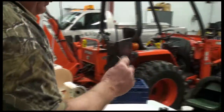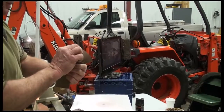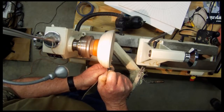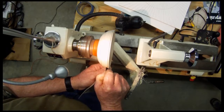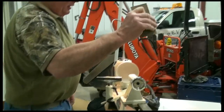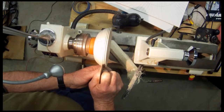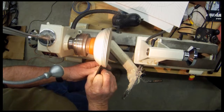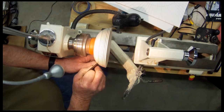There are a couple of ways to burn in these lines. Wires work good when you're fairly straight, but they don't work at all in a curved situation. I bought some really stiff sandpaper belt at a surplus store — probably five or six hundred feet of it, 120 grit. This is the way Nittman says to do it — he uses the edge of the sandpaper, and it helps if you've got a variable speed machine. You get two results: it sands the edge as you go. I've since switched to using plastic laminate tabletop scraps — I like it better. It burns a little deeper, a little quicker, and it radiuses to conform to the piece you're burning.